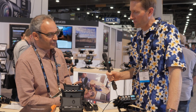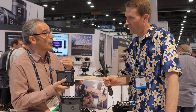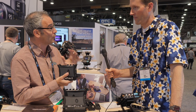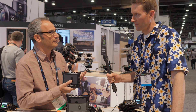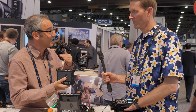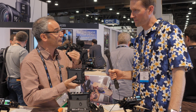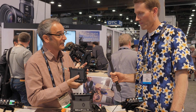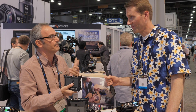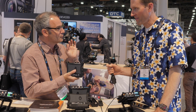It's a different design. One of the important things about these products is we want to make them easy for an audio novice — somebody who's maybe less experienced with audio — to be able to capture the lowest noise, lowest distortion recordings. Those types of customers may not be as experienced in optimizing their levels. So we wanted to design a mic preamp that was extremely forgiving. The way we've achieved that is a discrete Class A mic preamp — there are no off-the-shelf ICs in our mic preamp. Off-the-shelf ICs are pretty good these days, but they can only go so far. This is a discrete Class A design: individual components soldered to a circuit board, optimized for really low noise.